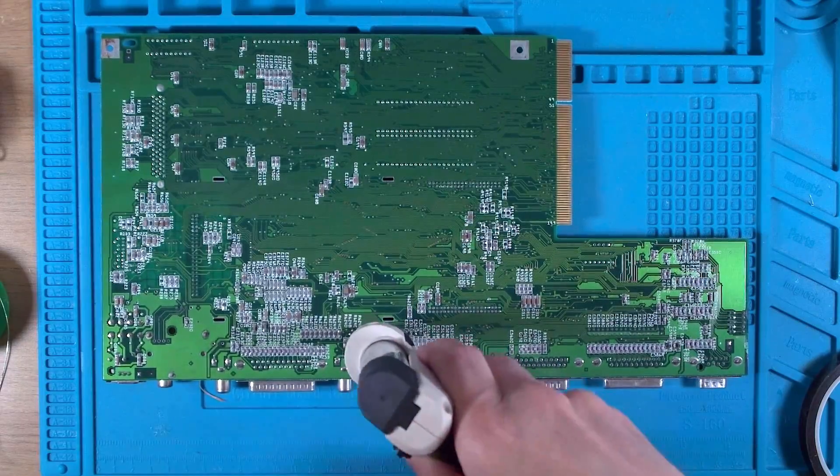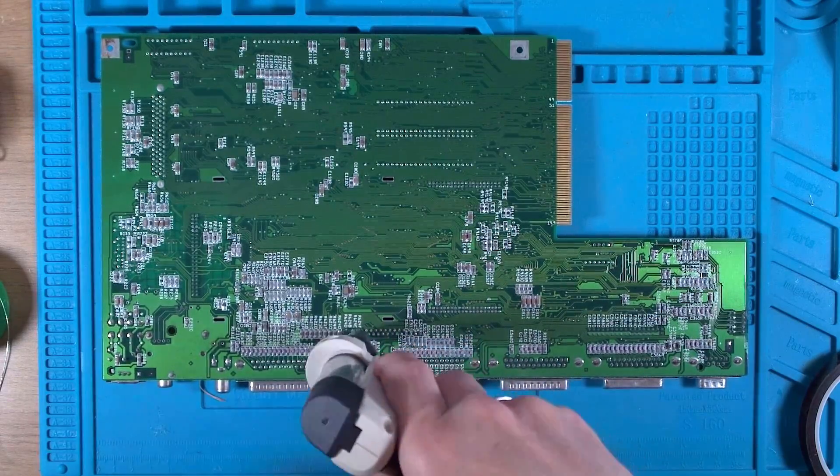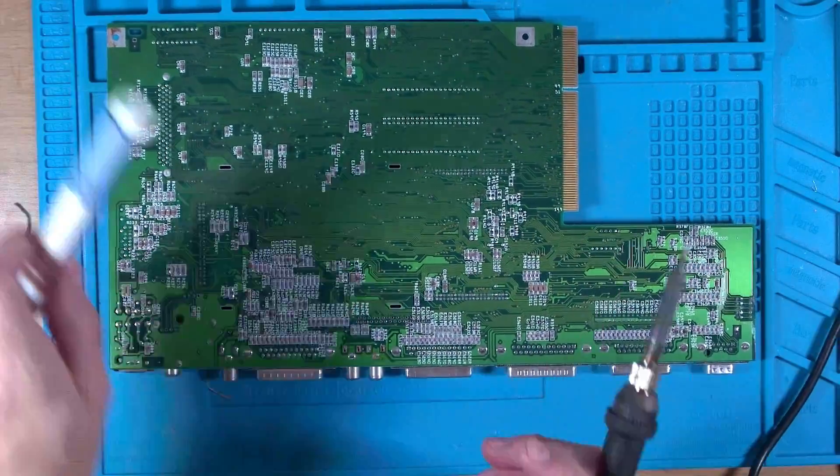As this is the method I'm going to choose, I'm going to desolder the keyboard connector first so it doesn't get damaged. I'm also going to desolder the audio jacks to keep them nice and safe too. And with all those plastic parts removed from the board, it's ready — so let's go find that short.